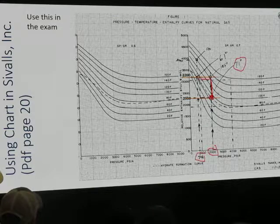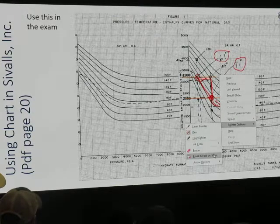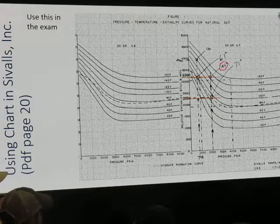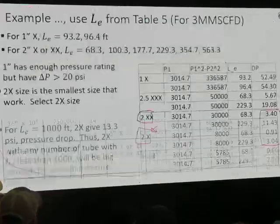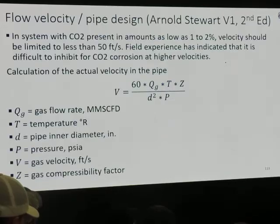and then we choke it. When we choke it, the temperature will drop to about 70 again or something. Or it dropped to 61. When we choke it, the temperature dropped to 61. So Joe, 125 is before or after the choke? Before. Okay. So we heat first, then we choke later for single pass. If it's split pass, we heat, we choke, and then we heat again.